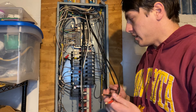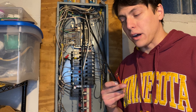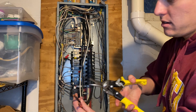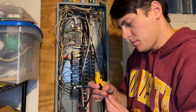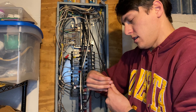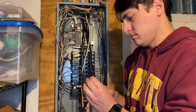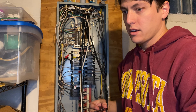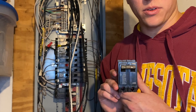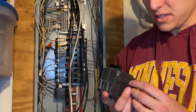Now that we've pulled our wires, the tips have lived a difficult life getting pulled through conduit, so we're going to start by trimming them to get a nice clean end. Cut down and peel the insulation away — that ensures we don't cut any of the fine strands in our 6 gauge. Now we take our breaker. This is just a 60 amp ABB breaker that fits a GE box, type THQL.